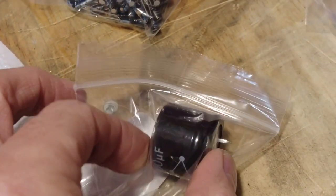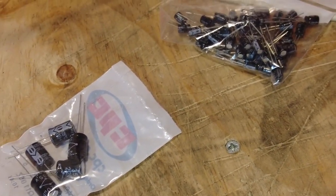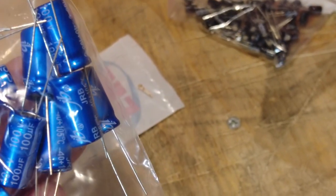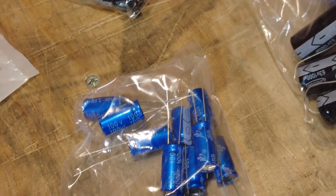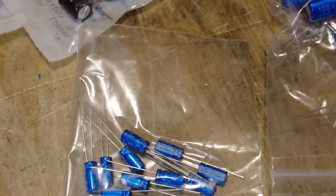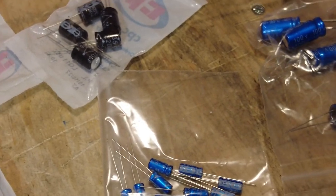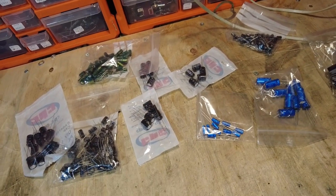These are 30mm - notice they're a lot shorter than the older caps, but as long as we get the diameter that should be fine. I've also ordered 1000 at 63 volts, 100 at 100 volts. I've ordered the higher rated voltage versions because some of these capacitors are really tiny now and I'm worried the legs won't reach. Some of the caps in there are axial, so I've bought a selection of the same microfarad but with different voltages to get different sizes. With that in hand we'll make a start on changing one or two components.